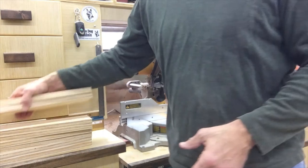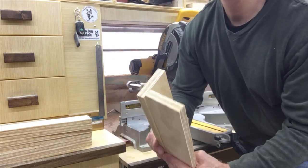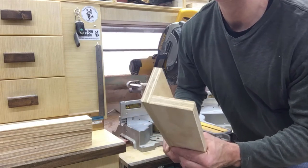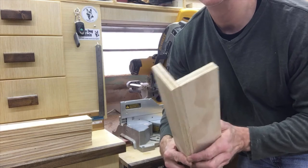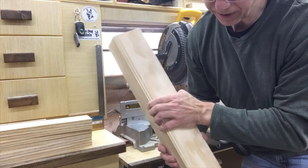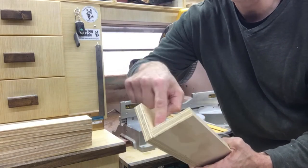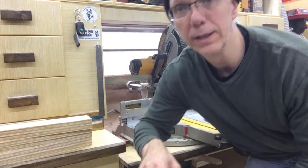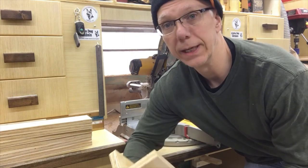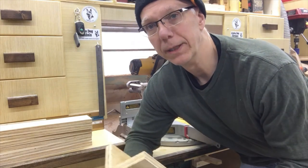So that works out really well. And so the legs, I've made 8 cuts because I'm going to drill some pocket holes and screw these together, so I end up with a leg that looks like this. And so that'll give me some pretty good strength. So now you see what I mean when I said that the legs would be screwed in this way and this way in that corner where there's a gap. These are going to help hold that together, so I'm not worried about losing any structural integrity. So now I'm going to set up and do the pocket holes.